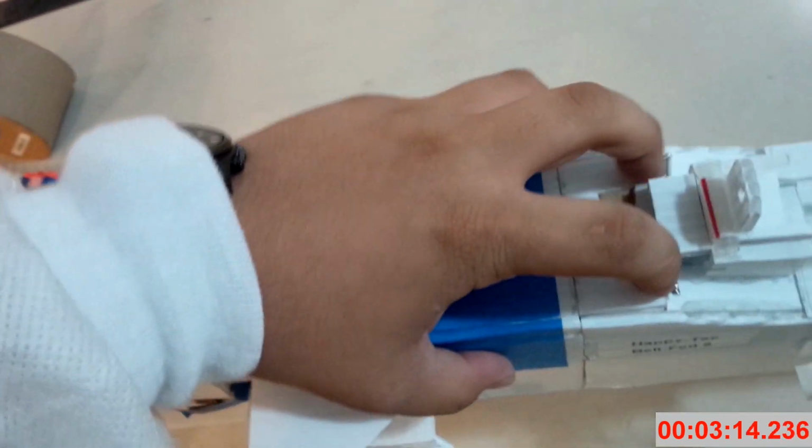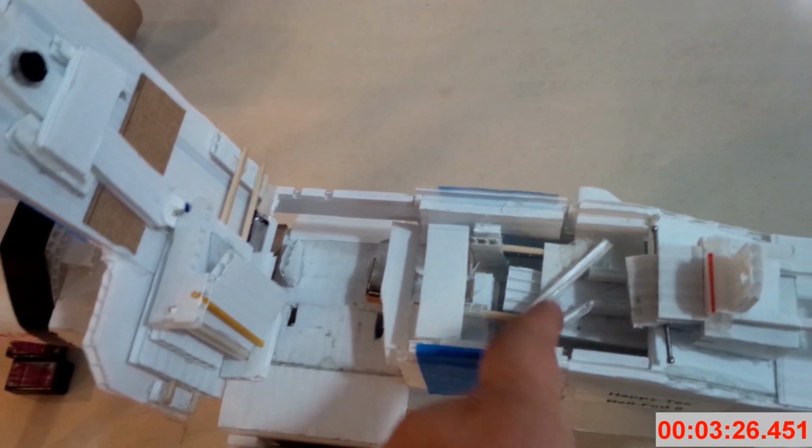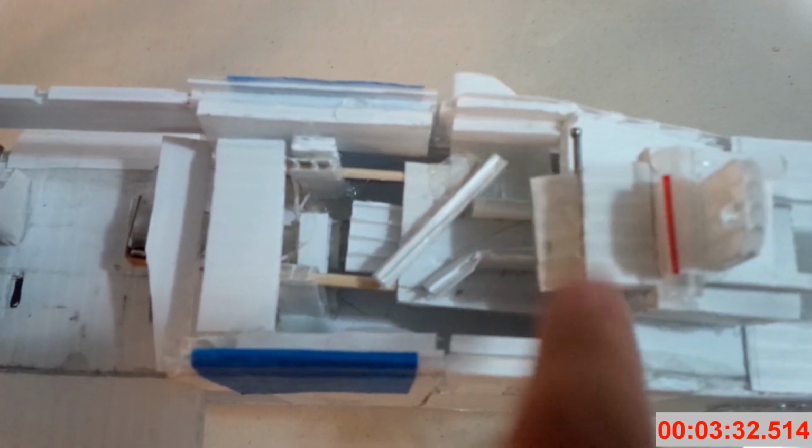Now, what really makes this gun different from most belt-fed dart guns I've seen is that I tried to emulate the real-life feeding of a real-life belt-fed. You probably see an M60, Browning, PKP. Any belt-fed weapon probably uses the same concept. In this case, if I open up the gun, on the bolt there would be a groove cut in. In this case, I put some pieces of plastic in a wall shape, so it makes a kind of J shape.